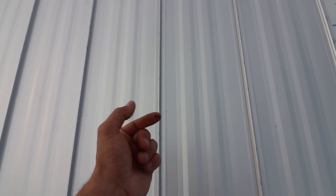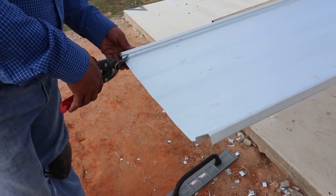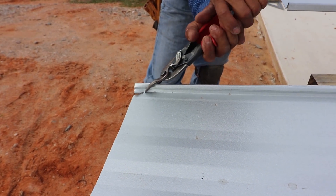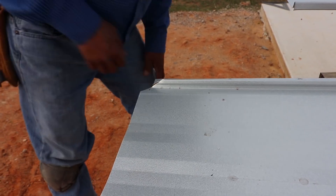This gets up off the deck, so if you don't have a complete joint all the way down, you have less chance of it leaking because you don't have any standing water — it's an inch off of the deck. This obviously isn't lead; this is Galvalume steel, 24 gauge — a very heavy duty gauge. You can go lighter, but make sure if you're wanting to prevent oil canning, you go with the heavier gauge. It's just a higher quality product. It is going to cost you more, but it's definitely the higher quality stuff, especially if you live in areas with hail storms. You don't want this thing dented up when a hail storm comes through. So 24 gauge standing seam Galvalume.